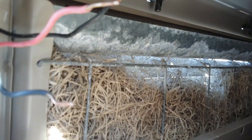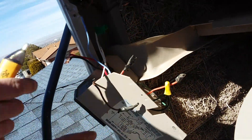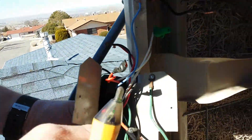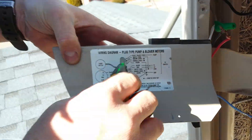And the two blacks coming from downstairs — I'm gonna assume the white is still the common, and they ran common as white up here too. These other ones are nothing yet, nothing going on with these yet. The orange and white — those are 240 volts. We're not worried about that, we're on 120. Okay, let's go downstairs and trip a switch.